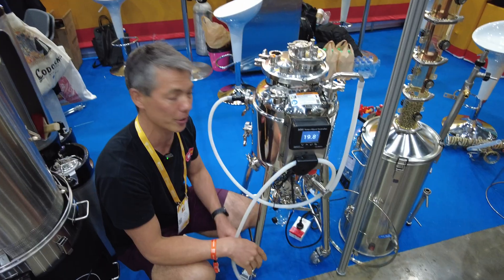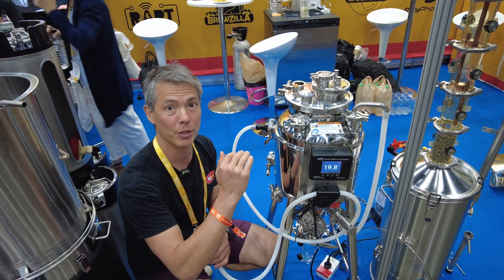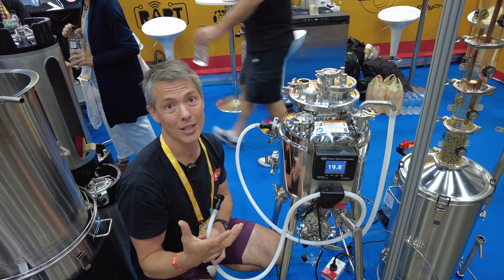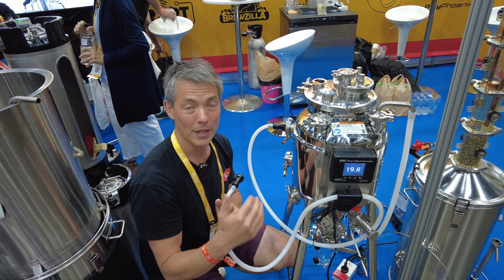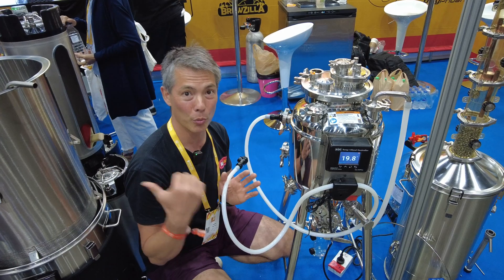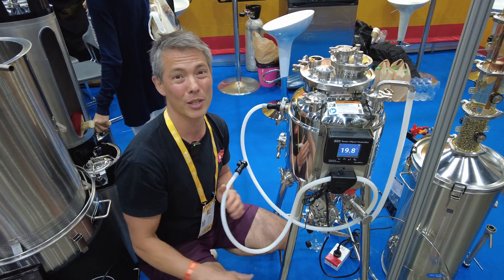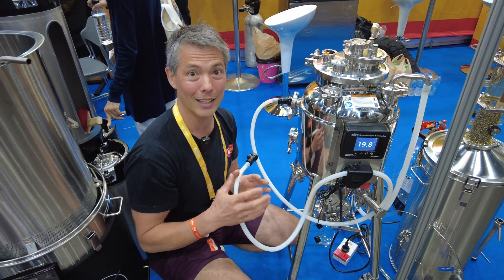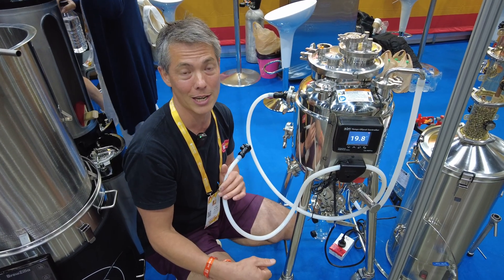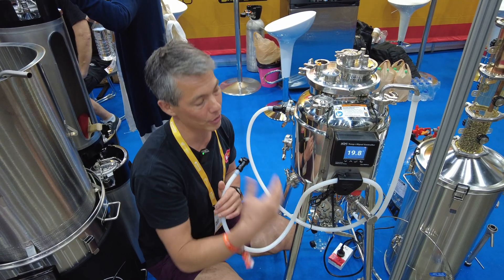Several reasons why I've gone in this direction. What you'll have in this type of setup is one pressurized line which is constantly pressurized with glycol in it, and then the pinch valve will gradually open and close. It means that we can use things like PID control for cooling. PID for a lot of brewery stuff I'd say is not necessary for heating in a lot of small breweries, in my opinion. However, when it comes to cooling in particular, the thermal mass of the liquid is quite substantial and it can lead to things like overshoot if you have freezing cold liquid going into a fermenter when you just want to adjust by fractions of a degree. So I think that's where PID is really important, and these types of pinch valves can gradually open and close — that's really handy.